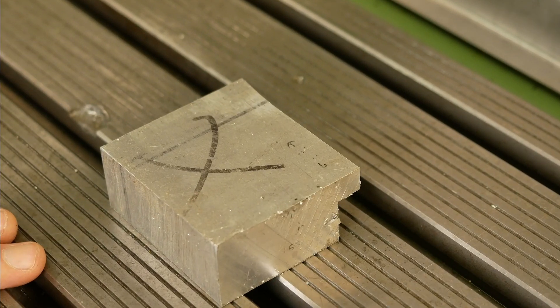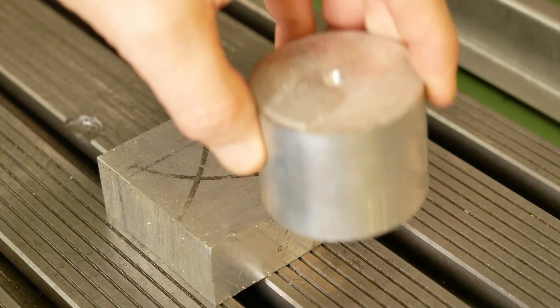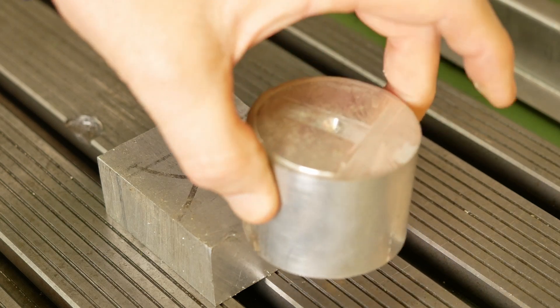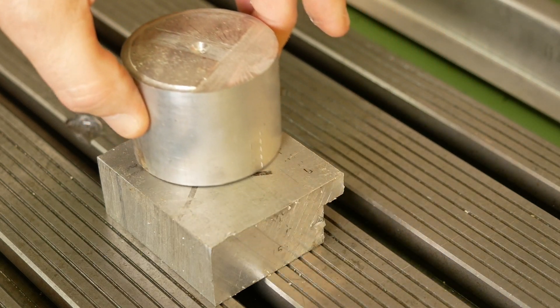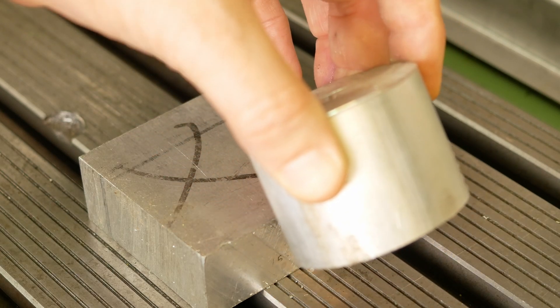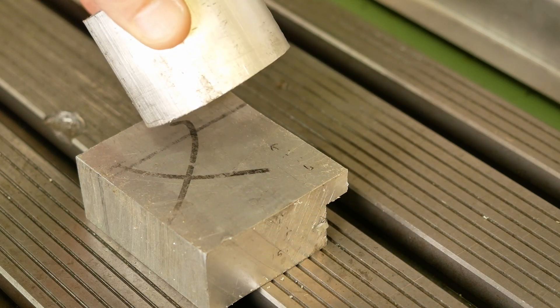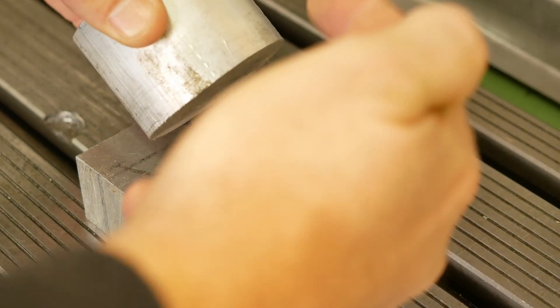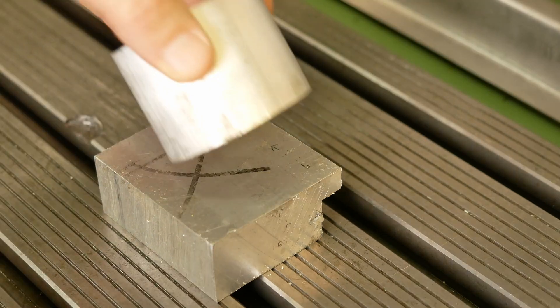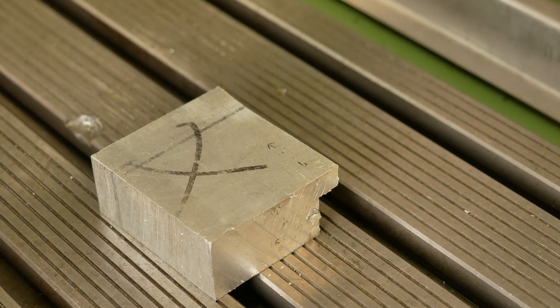So why do we care about tram? Imagine trying to surface this piece of metal completely flat. If this is our cutter, imagine if it was going across perfectly in tram — it'll cut a perfectly flat surface. But super exaggerated, if the cutter was offset at a big angle and went across, all it would do would be to carve a U-shaped trench into the metal. And the bigger the cutter, the more exaggerated that error is. Since we aren't trying to create trenches, we need our mill in tram.